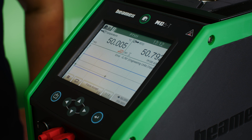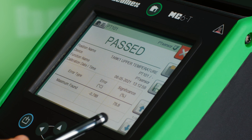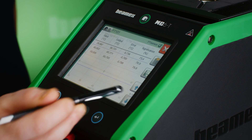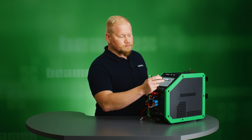The countdown has started. You'll hear the first beep — it's switched automatically to the second channel, and a second beep. I have a pass calibration. I can see my error and the significance of it. I can add notes if I like, which will be visible in the calibration certificate. I can see the results in a graphical view and also in numerical view, and I can add environmental information in this window. These results are saved for both sensors. I would upload the results to the calibration management software — either CMX or Logical — have my supervisor approve the results, and the job is finished.